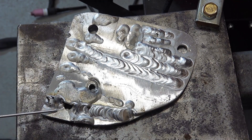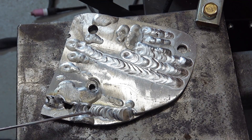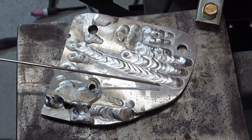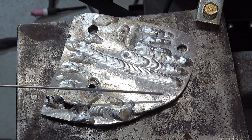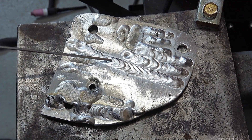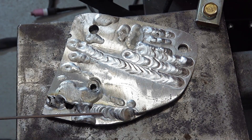Today I started here — that was with continuous current and obviously it's a real mess. But then I tried pulse. I've never tried pulse before in any form of TIG welding, so it's just adding to my experience. And straight away I got this. We went from this to this just by changing to pulse, and it's kind of miraculous really. This was not burning in enough, and this was my last run. The time difference between this and this was about three minutes. I'm very pleased with this, and I think I could probably have a go at an edge weld. So now I've got the confidence to have a go at that cylinder head.